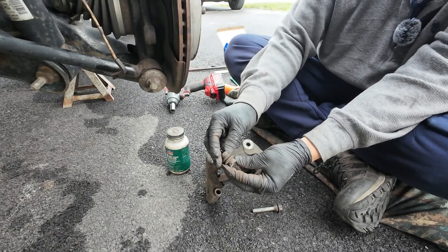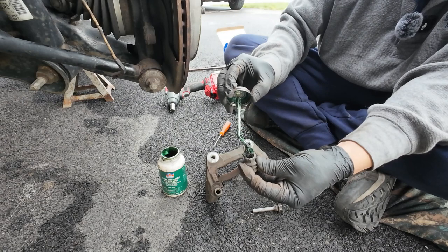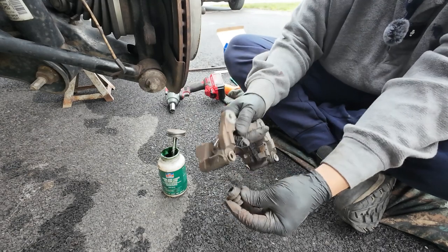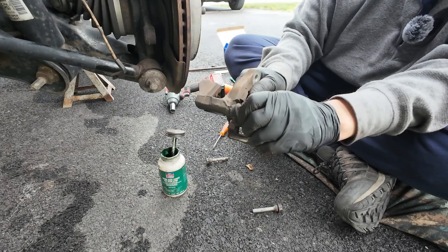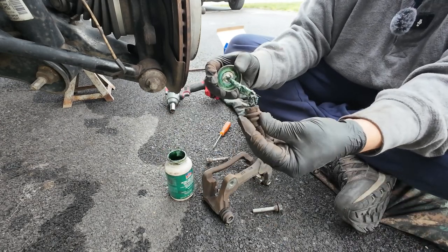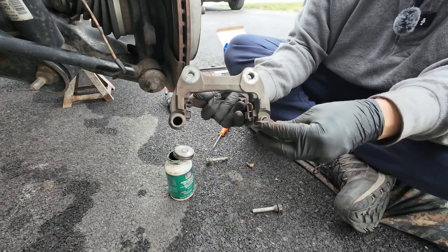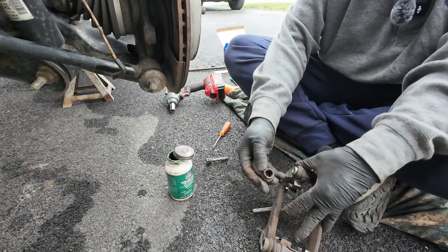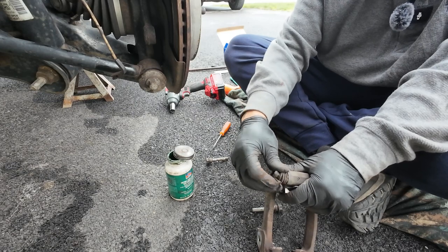These go back — it doesn't make a difference which way you put it; they're exactly the same. What I do is put a little bit of this grease on the lip, then force it back up in there and twist it. That gets grease all over the outside, lubricates it, and keeps it from rusting. Put a little bit on there, then put that back on and spin it. Put that back on and spin that around so it lubricates the whole pin.